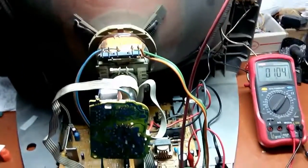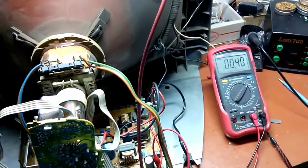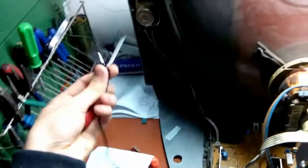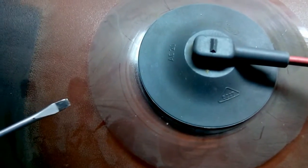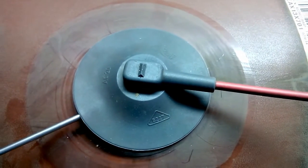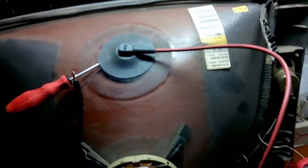The voltage was quite a bit higher than it should be, mainly because I changed transistors and didn't use exact replacements. I want to show you what too-high B+ voltage does. Using the usual tool to discharge the picture tube — listen carefully — I just started inserting the suction cup and I already got a spark. Way too high B+, way too high HT.